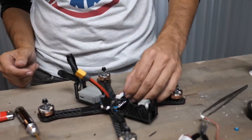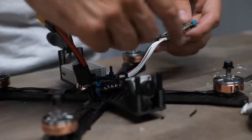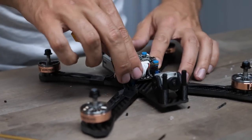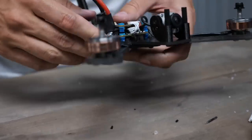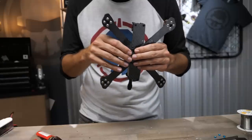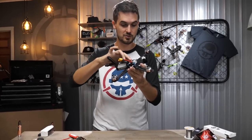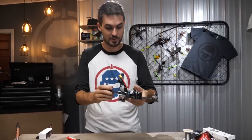We've got the two boards plugged in. Now grab the non-threaded blue spacers and drop them right on. With spacers on and boards plugged in, route the cable cleanly between the two boards and hold it down as you slide the flight controller onto the stack screws. Hobbywing has the soft-mount gummies pre-installed in both the 4-in-1 and the flight controller — that's always a pain to do, so they made this really easy.